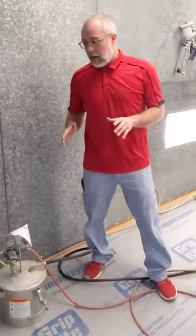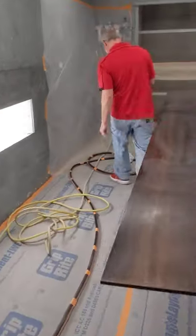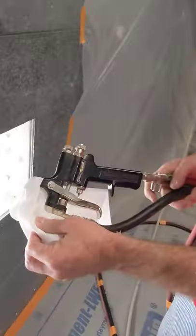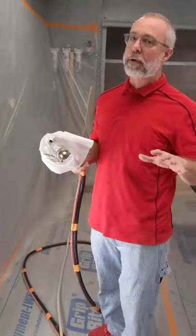The polyester is a pretty nasty product — it dries so quick, it's super thick, it's sticky, it's just a down-and-dirty process. So we use a really old pressure pot for this and a really cheap gun. We're going to use our $70 Central Pneumatic with a 2.0 tip so we can get a ton of product on.